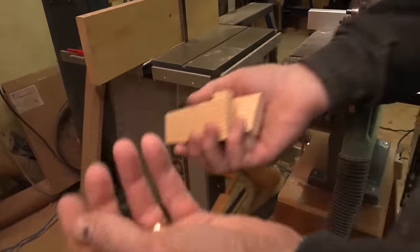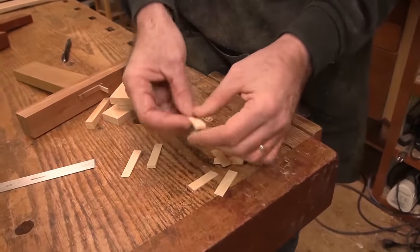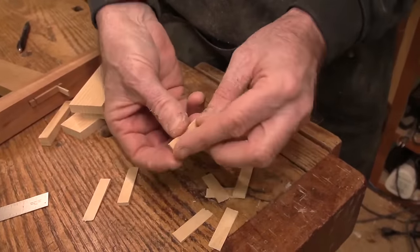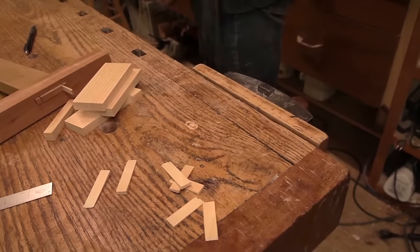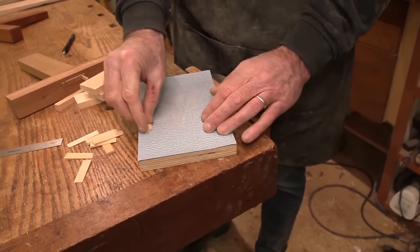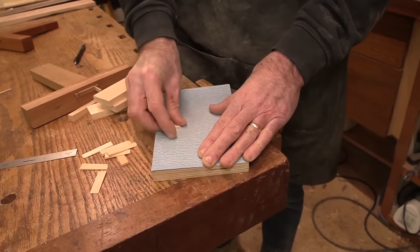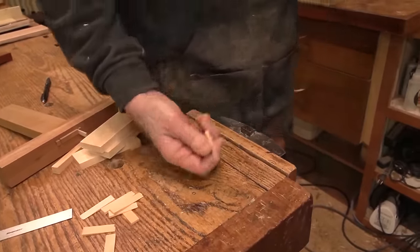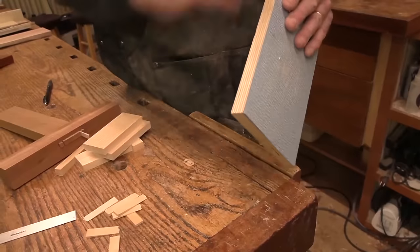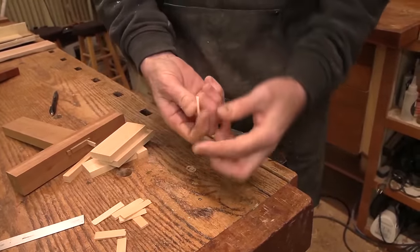We've got eight nice, perfect tapers all set there, ready to go. Now, if your bandsaw is kind of wobbly and it leaves a lot of roughness, you can take the wedge, if you like, and run it across a little sandpaper like that. But I get a smooth enough cut right off the bandsaw that you don't need to do that. By the way, that's just like 150 grit with a spray adhesive on a piece of 3/4 inch plywood. So anyway, there you go.